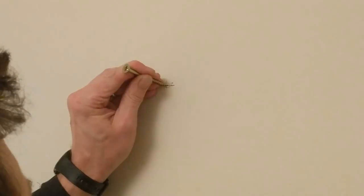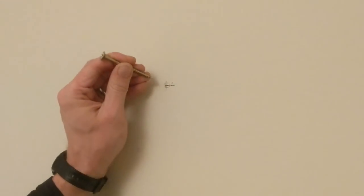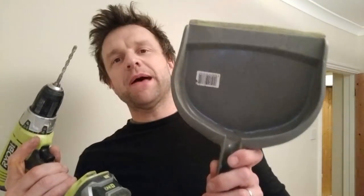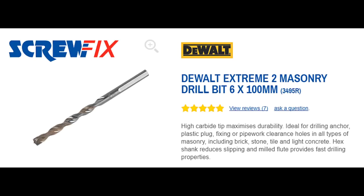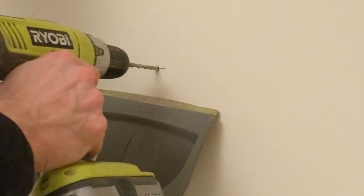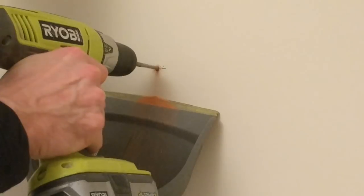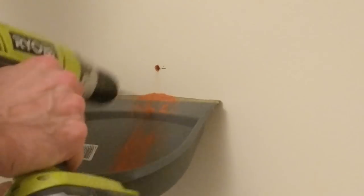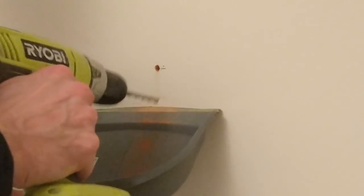Right, we're ready to start drilling. I'm going to mark the position I want to start — you can use a screw and your hammer, or a punch if you've got one. A really good little trick: get a dustpan and hold it under the hole — that way you catch all the cement dust rather than having to hold a hoover; it's much more portable. I'm starting with a six millimeter drill bit, going on to hammer action. Tap all the dust into the dustpan so you catch it all. That's actually a really good wall — it's solid brick and we should be able to get a good fixing in there.